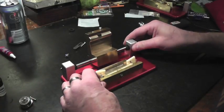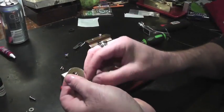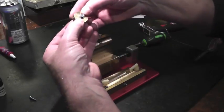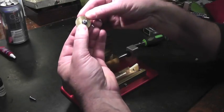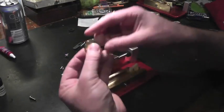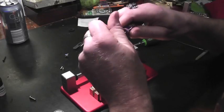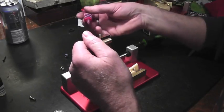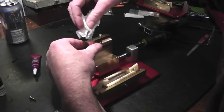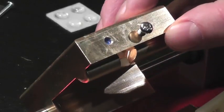Very good. So now I think we'll put our spindle bearing on with the oval screw. There are two washers, one for either side. There's two ways to orient this thing, and I would choose the screw closer to the right side of the center, and we're going to put that on. But first we need thread lock, and this is important for this thing to function properly. And this is blue thread lock, and we're going to put a drop. This comes out rather quickly, so we've got to be real careful. You don't have to completely fill it, but a drop must be present. And that's about the right amount of thread lock.